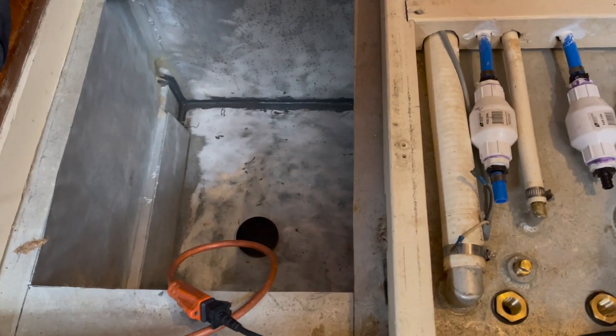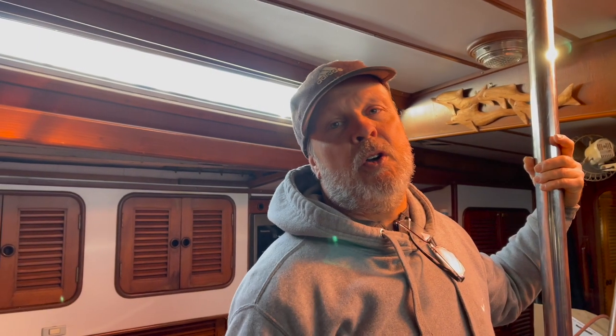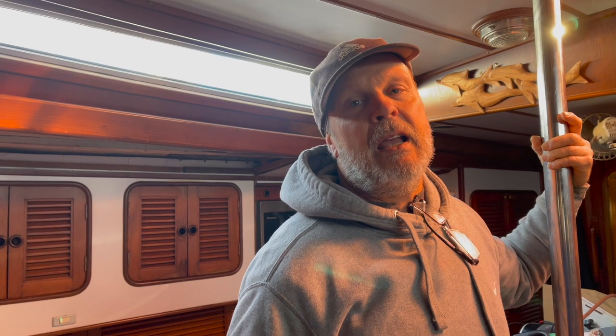Even the water tank — when I first started, I filled the tank full of water and the tank had a leak in it. I had to cut a hole in the tank. You can see all around that whole tank — that's JB Weld. Everywhere where there was a seam, where they welded the tank together, it was pitted really bad, and there was a hole way back up in that corner. We're going to see if it works. You could put three coats of food-grade epoxy inside the tank and coat it, but I think the JB Weld will hold it and it'll be fine.